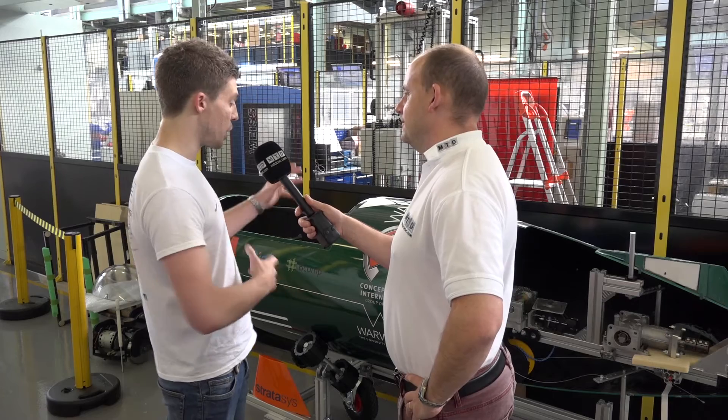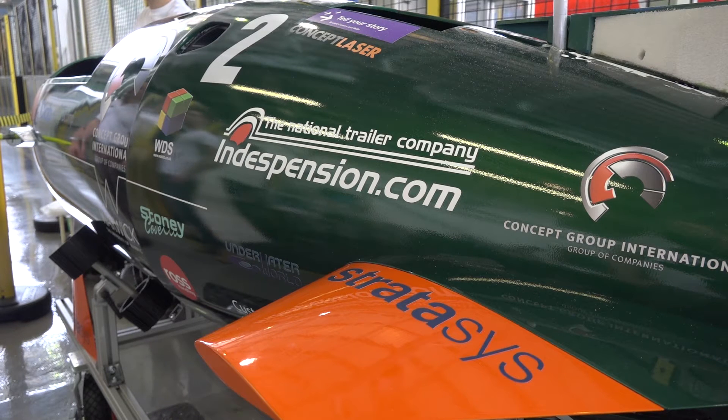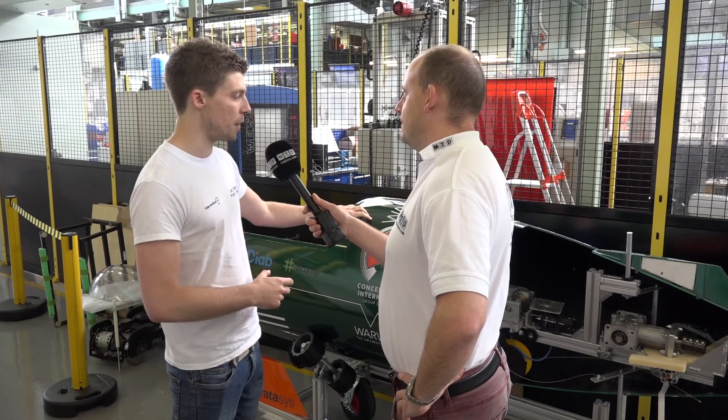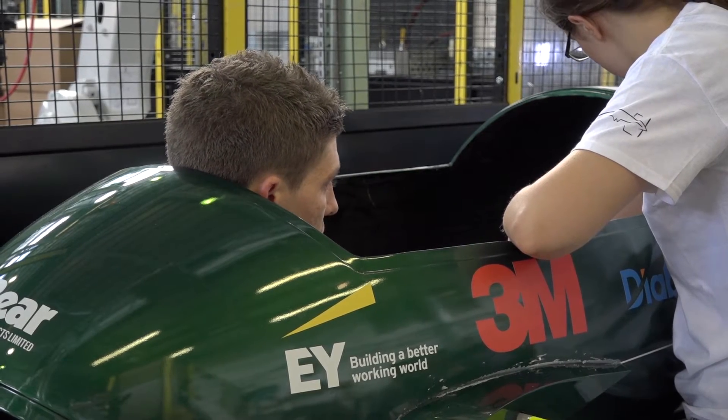One of the key criteria is not just winning the race, but you're also judged on your innovation and use of novel materials. A key innovation this year is our hull — it's something that's never been done before, especially in submarine racing. It's a biodegradable, environmentally friendly hull made from a composite of glass and flax fiber. Now, flax gets wet and falls apart, and we did all the research behind this — it's a carryover from last year.